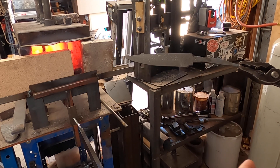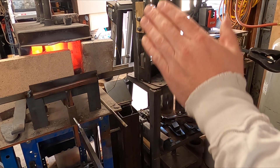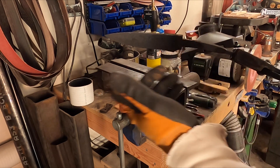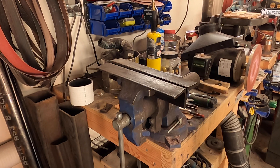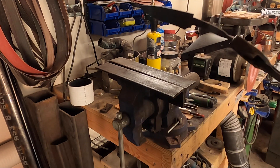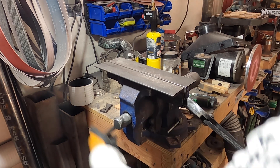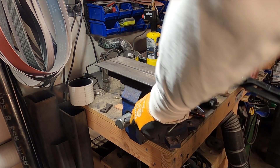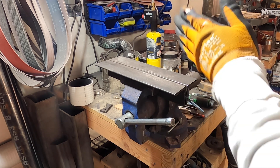I have a little jig with C-clamps that I'll put on it to bend the warp in the opposite direction when I'm tempering. If I pull this out and saw it start bowing one direction or another, what I would do is come over here to the angle iron setup in the vise, put it in here like this, and then just crank it as tight as I could and leave it there until it cools — that should pull the warp out.